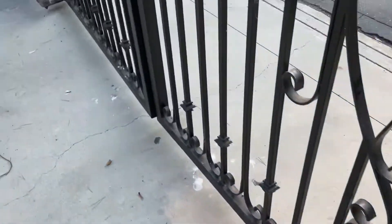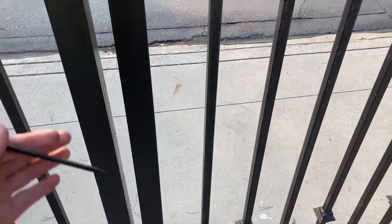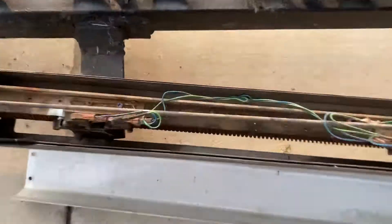Let's say that the gate is misaligned — this gate is a little bit in. I've already adjusted it, so I'm not going to do it again. But if these gates are not closing symmetrically, what you can do is adjust your limits.